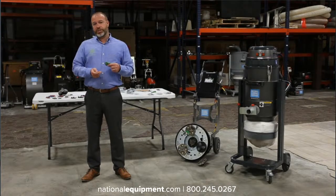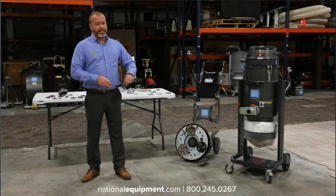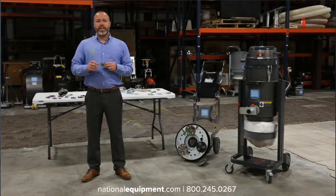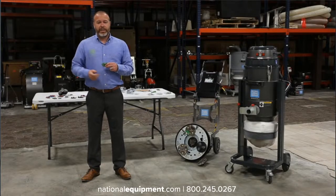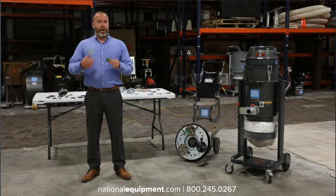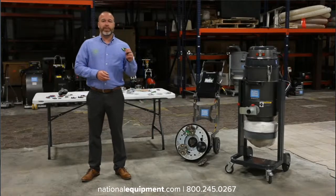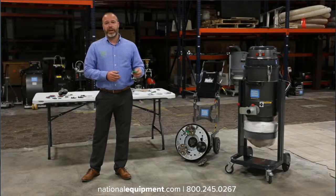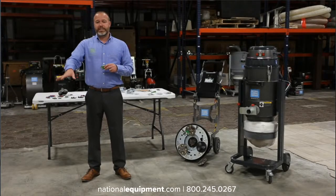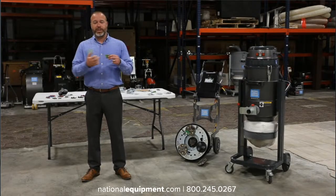I've heard of flow torches. I think the easiest way to do it is just to put some, especially if you're dry grinding, some silica sand down on the floor and run your diamonds through there, because you're creating enough of that aggressive friction that's going to actually reopen those diamonds. If you're wet grinding, these grinders are not really meant for wet grinding, but if you're using some of our bigger ones like our GP700, GP1000, you could actually put some water in with that silica sand, and that's going to keep the friction from building up and let that sand really aggressively open up those diamonds.